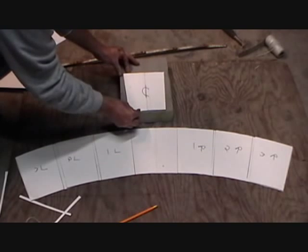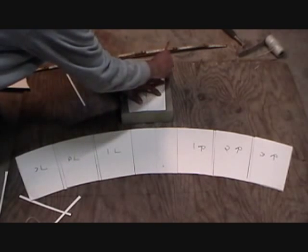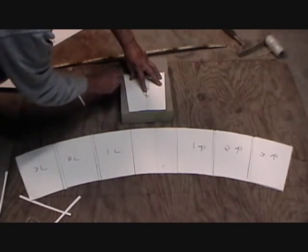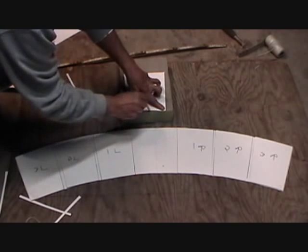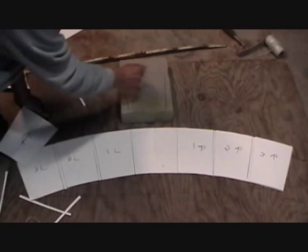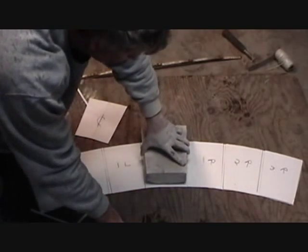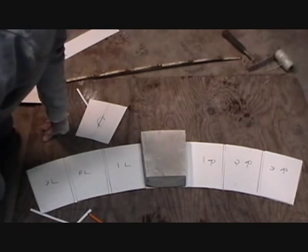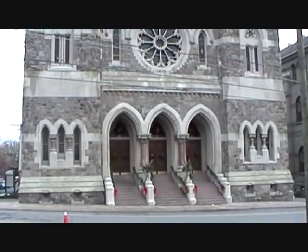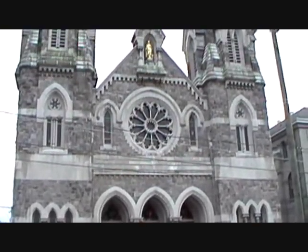We take this piece — this is a piece of limestone, same as what they built cathedrals out of — and we find the best possible place, then we trace our arch on the stone just like this. This is out in the field work, not shop work; this is more for country arches and residential areas. We pull it away — that's the impression of the arch. We went outside with the saw and we sawed our first piece of limestone. That'll be our first example of an arch. Here's an example of an arch on a church — a limestone arch. This is a church in Pittston, Pennsylvania.